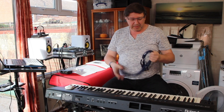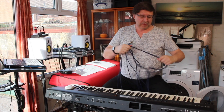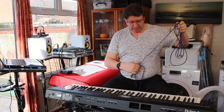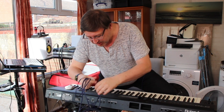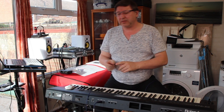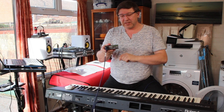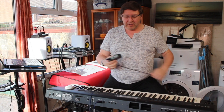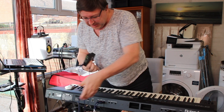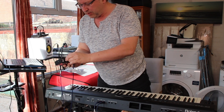The first thing we're going to do is plug in the MIDI cables. I have two MIDI cables here. I'm going to take one standard five-pin DIN MIDI cable. To record from my keyboard I'll come out of the out socket on the keyboard and take it into the in socket on my MIDI interface — the in socket on this interface is on the front. Then to send data back to the keyboard I'll plug the second cable into the in on the keyboard and that goes into the out on the USB interface.